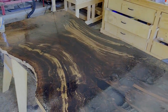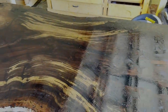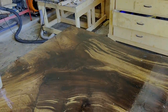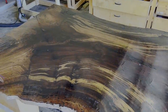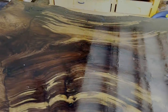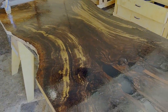I kind of forgot to start recording when I was doing something important. There were a lot of soft areas around the slab and you can see it in that corner - it's absorbing a good amount of the epoxy right now. I wanted to stabilize all those soft areas so my sanding would be easier, because softer areas tend to get taken away a whole lot faster than stable areas. Important to note: if you're going to do this, you need to seal the underside as well, because the slab needs to absorb moisture at an equal rate on both sides - otherwise it'll cup.